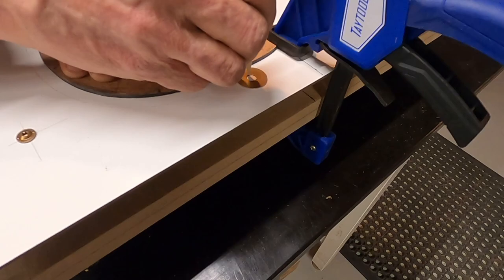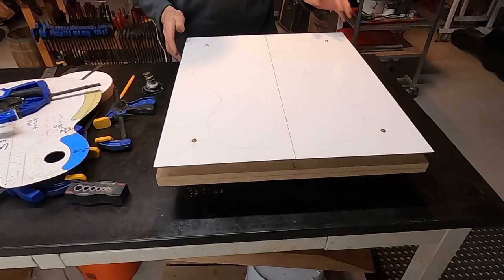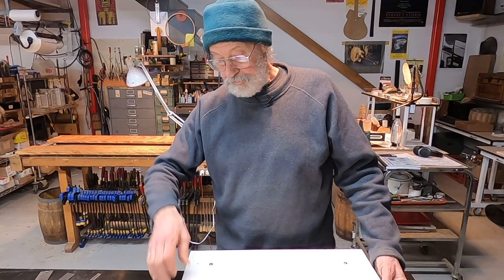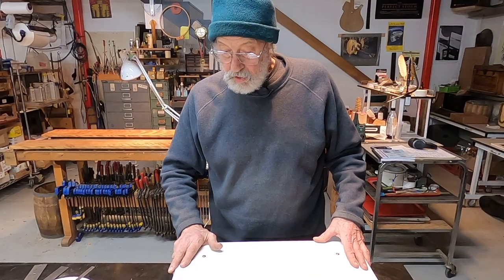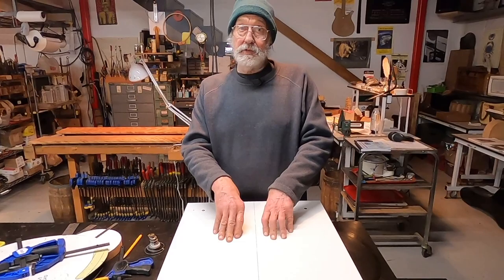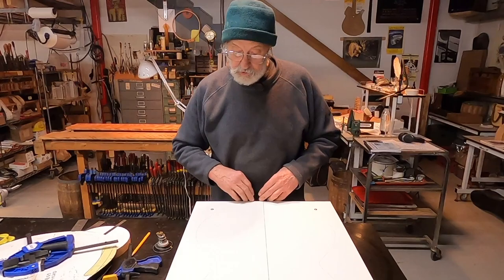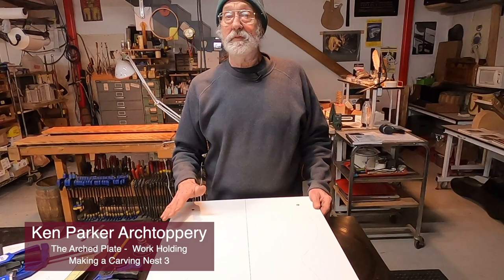All right. So now we're ready to saw this out on the bandsaw. And we'll try and just nick the line on the outside of the line. And again, this part we're looking at will be face up on the tool. And when we release the inside that we just glued up, we'll have a base for carving the outside of the top. And then we're going to make a mold of the finished carved top with the surround that's left over, and have a beautiful nest to hold the top upside down for rough and finished carving, tuning, and then bracing finally.